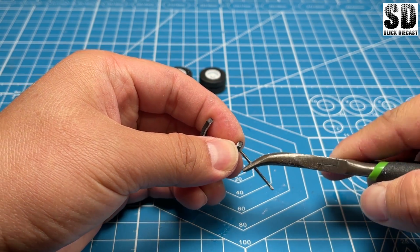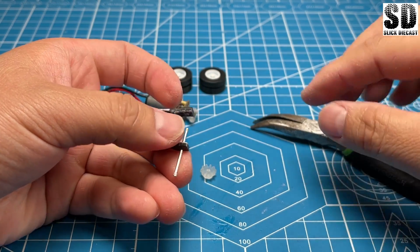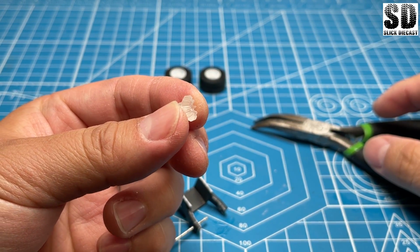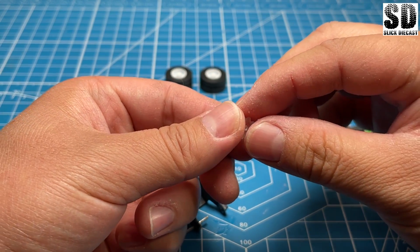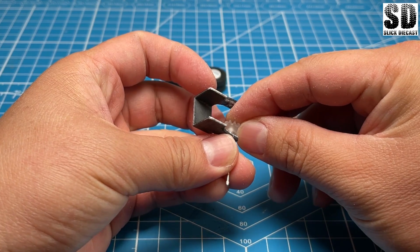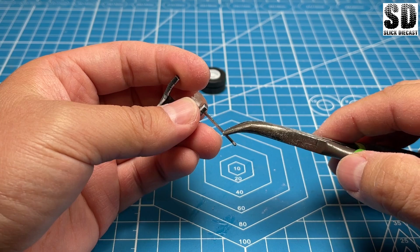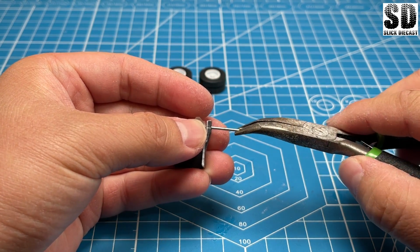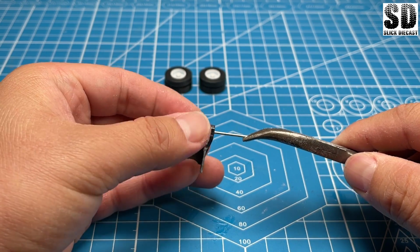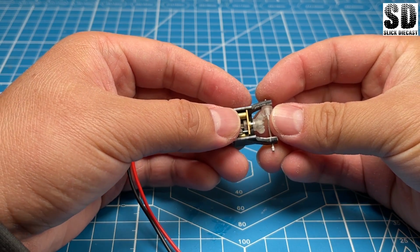And I basically used the same axle that came with the car, because it's basically the perfect width for what I've designed previously. And these bevel gears I designed in Fusion 360 using a program, and they came out pretty good. It's just that I wanted these gears to actually be smaller, but I printed the smaller gears and the teeth were not strong enough. The teeth were breaking. So I just scaled it up a little bit so I was able to print these out. Now the motor will go in here like that.